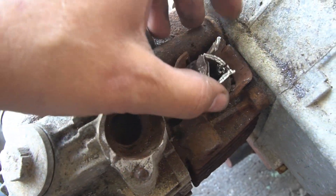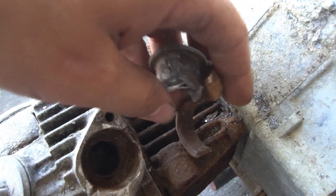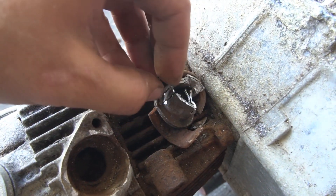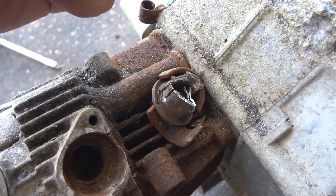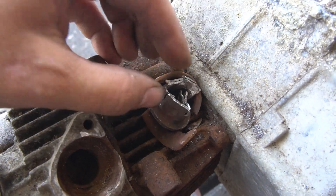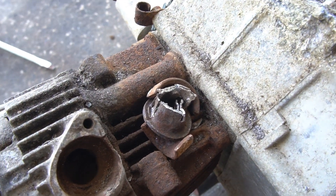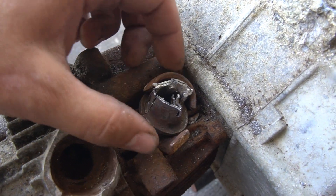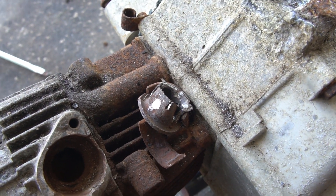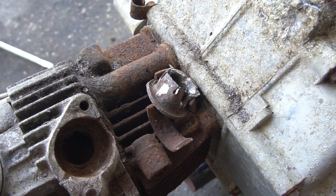Nothing else got broken — the collar, the split collars for what was in there along with the flange of the pipe. By using that multi-tool you're able to give some slits. I had to use a screwdriver on this example and just kind of pry it around. It gives the metal an opportunity to re-bend and move away from the split rings and the wall where all the corrosion is. Plus that vibration of the multi-tool puts a ton of vibration that works in your favor to break this stuff up. I didn't use heat on this example, but maybe some heat and penetrating oil — add that to the mix and you've got an easier job ahead of you.